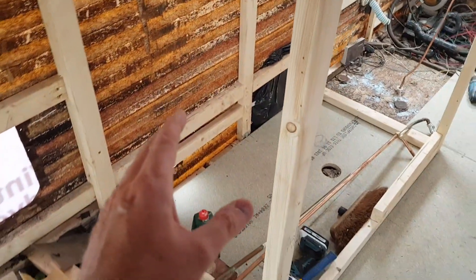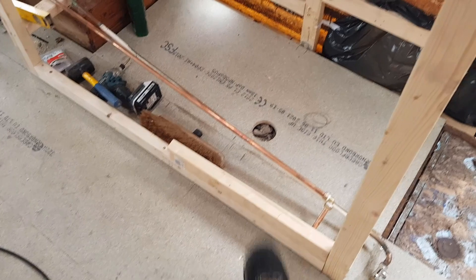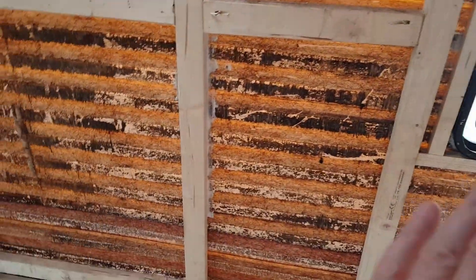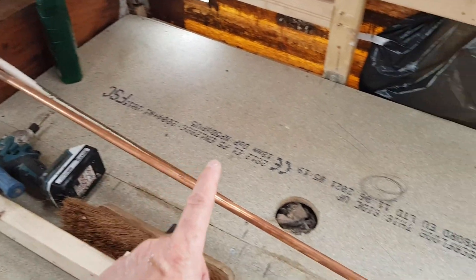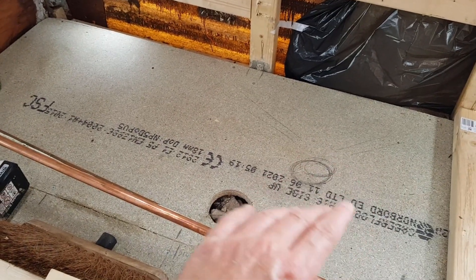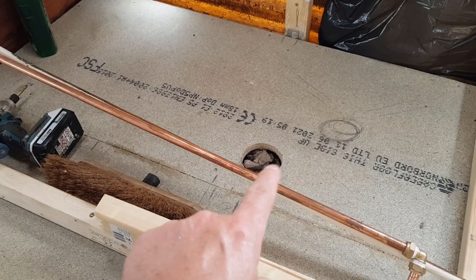Next door is going to be a really nice big shower — that's set out now, the frame size is done. That piece of wood's just loose on the bottom at the minute; we're just figuring out how big a step we need to keep the shower water inside. All this is going to be ply-boarded out and then completely glassed over with fiberglass resin — a solid waterproof box Rob is building. A gradient plug hole is going somewhere over here, so we're building our own gradient in so we've got enough slope if we park on an uneven pitch. We need to deal with getting that water away with some kind of shallow U-bend — it has to be really shallow and we're struggling at the minute, but we'll find something.